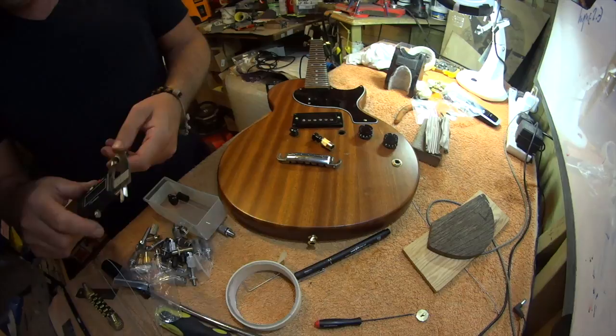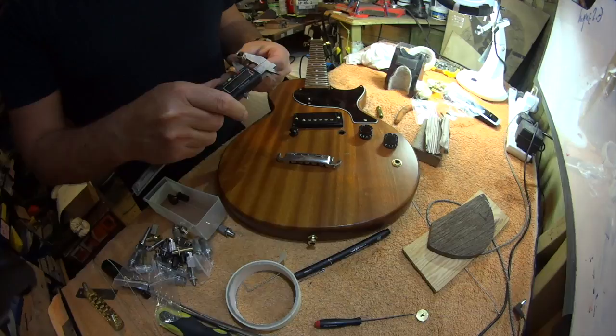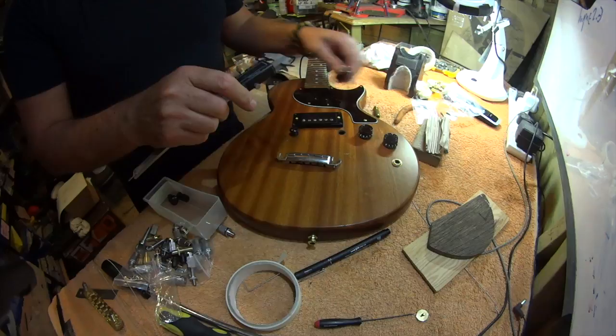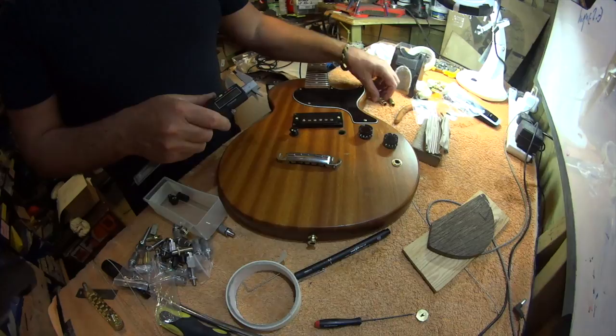So that's 11, and this would be a hole of, so that's 11.50, and that is 12. Typical half sizes, 11.50. So what did I say this was? So the hole would be 11.50. This hole is currently 11. Probably even widen this out with a Dremel rather than re-drill it actually.